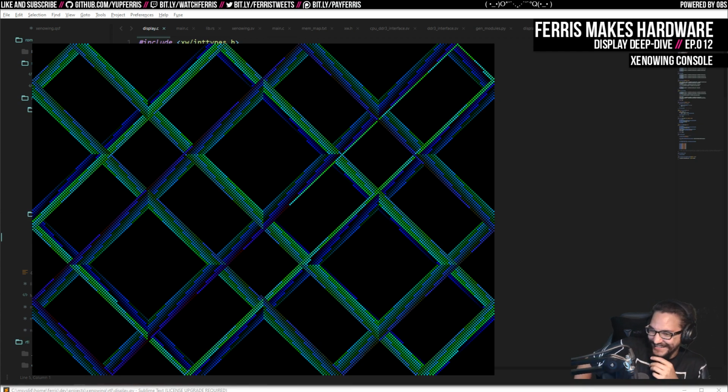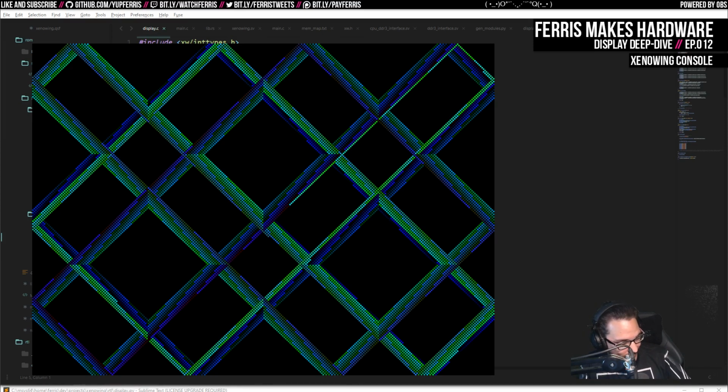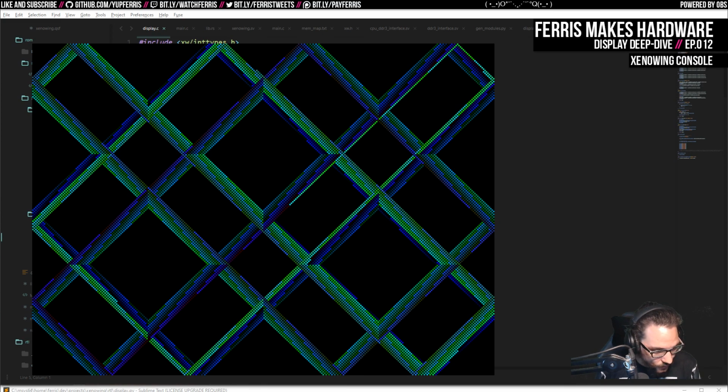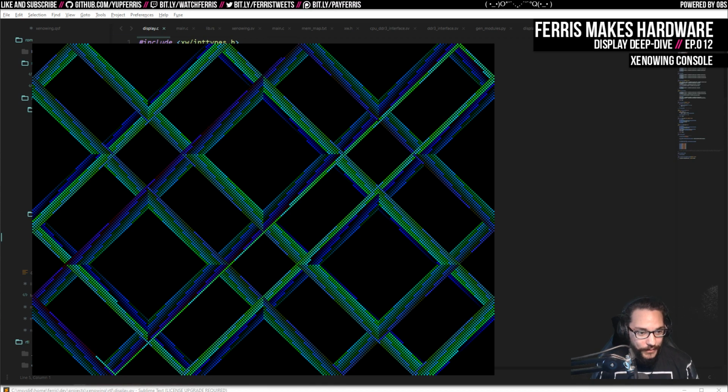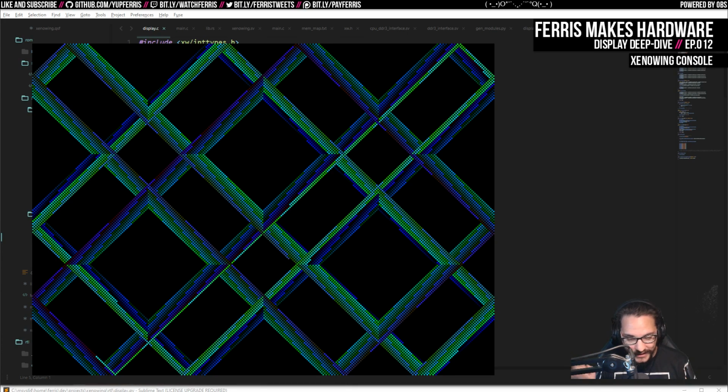That's what it is. But yeah, I did some math on that, and I won't repeat all the math because it's basically based around, I took some traces of the CPU reading memory to see how long that latency was. And typically when the CPU reads memory, it takes like 20 cycles for us to get the data back. So there's like a 20 cycle latency. Now, the memory controller actually gets way better latency and throughput if you do a bunch of reads in a burst, so that isn't necessarily an issue, but the patterns I was looking at were worst case. So worst case, we'd get like 20 cycle latency or something.